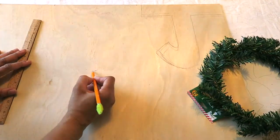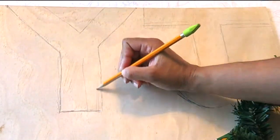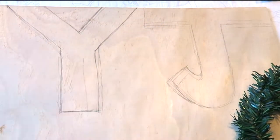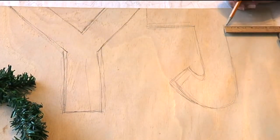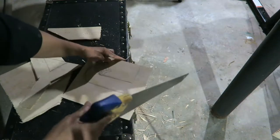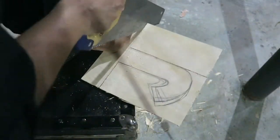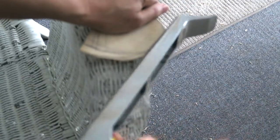I'm using this wood because I already had it, and just showing how I traced out the Y and the J using the ruler. I made the letters about two inches in width, and then about nine inches wide and nine inches tall. Just going around with the final measurements here, making any adjustments. Then I'm just sawing that apart — the wood is very thin and very easy to cut through, but as I was cutting it, it did leave a little bit of jagged edges, so I did something to correct that. I'm using this little tool to go around the bottom of the J and round out that bottom part.